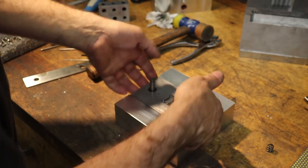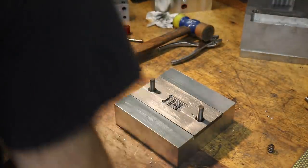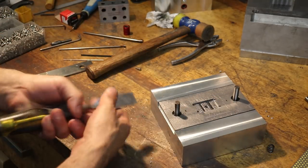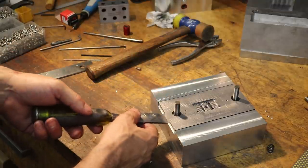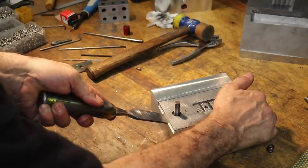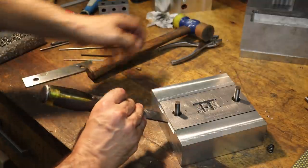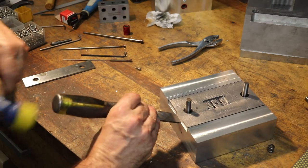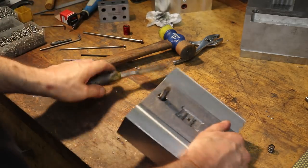But that went in with so much gumption that I'm not exactly sure how to get it back off of that surface, short of using a chisel, which I use a lot. Let me get that. Okay, so when I forget to put screwdriver pry slots in, I use this woodworker's chisel, and I basically just get the chisel under the edge of the metal there, just enough to start it, and I'll even tap it, because there's not a good way to actually pull the stripper plate back off yet.